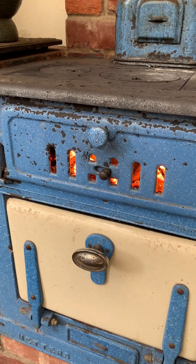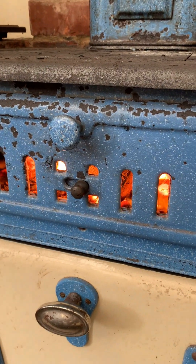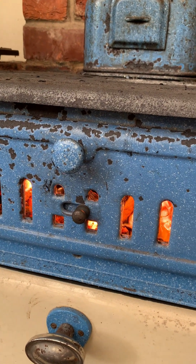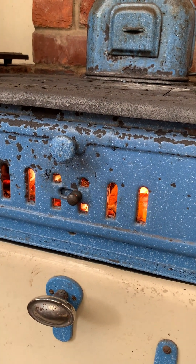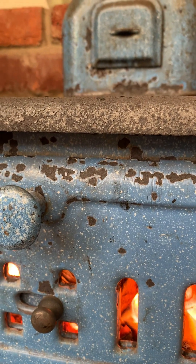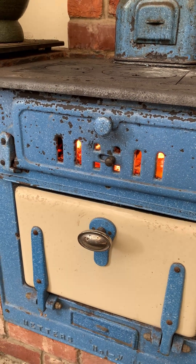Once the chimney becomes warm, you use what I call the turbo door — this little sliding piece that opens and closes the small slots in the fire door. This creates a rush of air through those holes and causes quite a hot, heated burn. If you listen carefully, you can hear the roar of the fire. You must get that roar of fire going before you commence anything else.